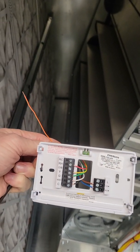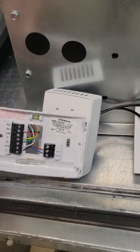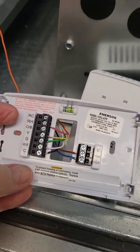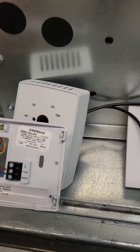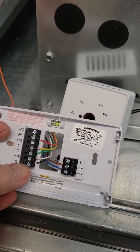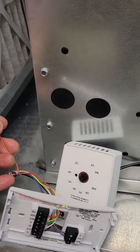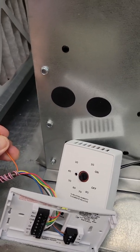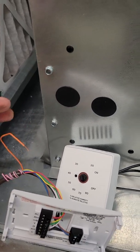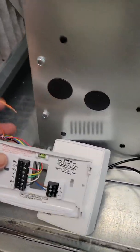if you've got a heat pump or gas heat you'll wire it differently. In this case it's just a gas heat unit — you'll notice I did not wire the O terminal, just the W terminals. If you want to power your thermostat you're going to need to land something on that C terminal. Wire number eight is going to be the return feed for the dehumidification call. We're going to run 24 volts through that dehumidistat and then send it back to the RH terminal.